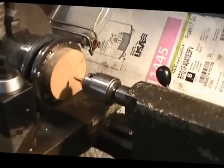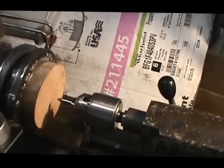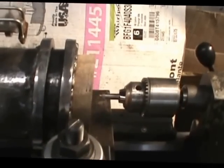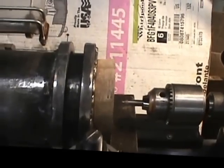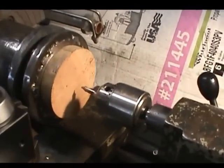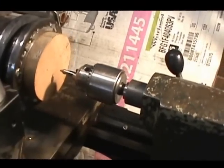Well, here we are today. We've got the hub where we completed the welding of the 1/2-inch square stock on to form the groove where the clutch collar is going to ride. Now I've got to machine that groove to width and just kind of true it all up. I've turned a small wooden block to fit into the bore of that piece, and I'm about to center drill that, and then I can put the center in it to stabilize it.